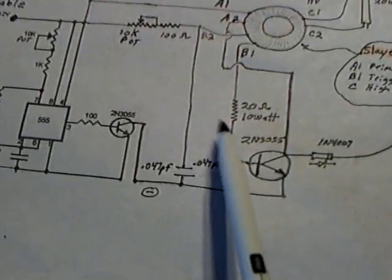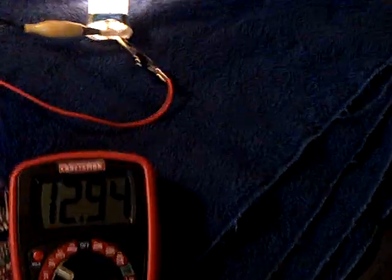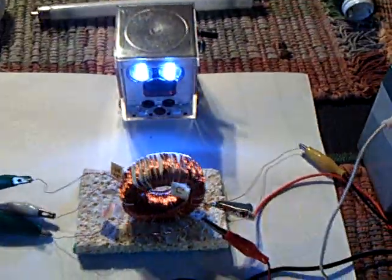What I've been able to do is eliminate the 20 ohm, 10 watt ballast resistors that were in the circuit. Now that I'm running at such a low amp draw, I went to just half-watt resistors — a couple of 10 ohm, half-watt resistors that go on the base of that transistor right there. Things are running real good right now. I really appreciate all the help from the people that have commented, are doing research, and are working on this with me. This is quite a circuit, and it was a bunch of people working together that made it happen.